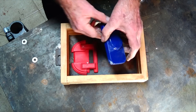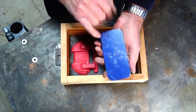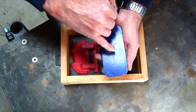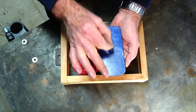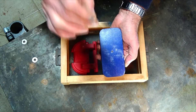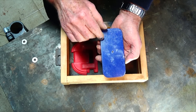I've got two different patterns here. This one has symmetry around two different planes, and on the other side I've drilled a hole that is exactly in the center of gravity of that pattern. That means you can simply drive a screw or rod in there and lift it by that point, and in theory it should come out vertically and shouldn't damage the cavity as it comes out.